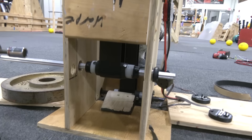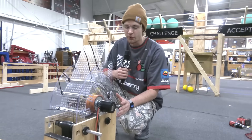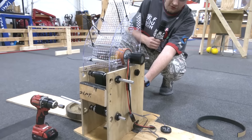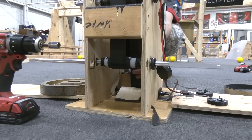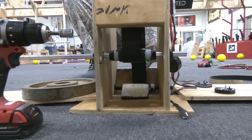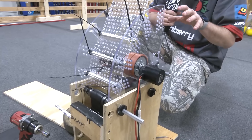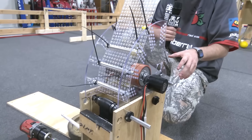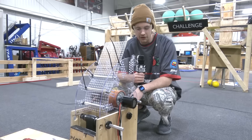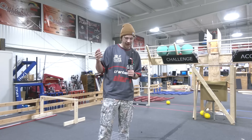Ultimately, we were running about a one-inch compression on the conveyor, which we decided was maybe a little bit too high. We got really good grab on the ball from the conveyor system, and with the belts the one-inch compression is good, but at the point of the pulley we found it was maybe a little too high. The 0.765 inches that we found with the shooter was like a really nice bread-and-butter spot — consistent results that enabled really good torque transfer to the ball, but also didn't result in too much energy loss.